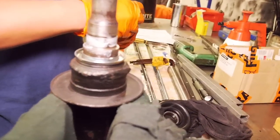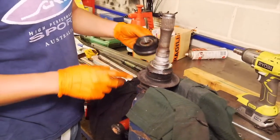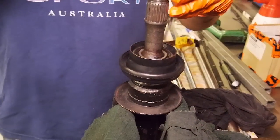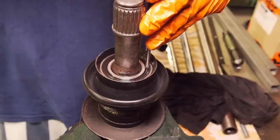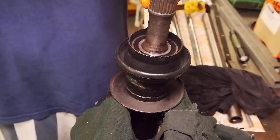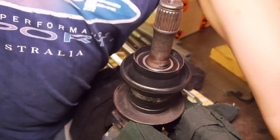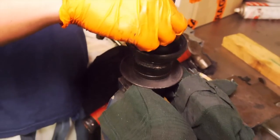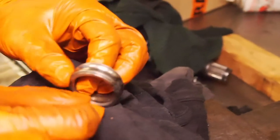As previously seen in episodes, a bit of mounting paste. Ben's favorite. In the absence of the mounting press, we're just going to... Make sure you do hit that inner ring, not the actual side of the cage. It's slow and steady, working each side, keeping it nice and true. Or if you're really clever, you could probably find a bit of tube - I think it's 30 mil ID - and use that as a spacer. It'll be easier, we don't have to be so careful. Pro tip: put a little nick in it.